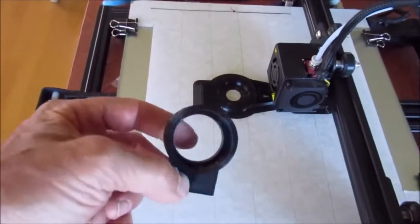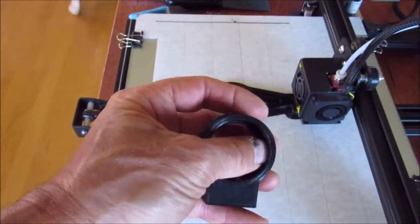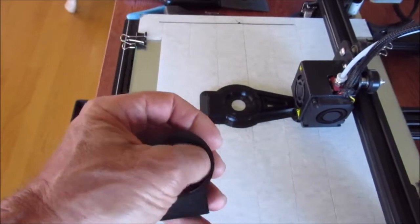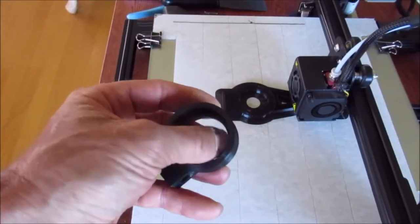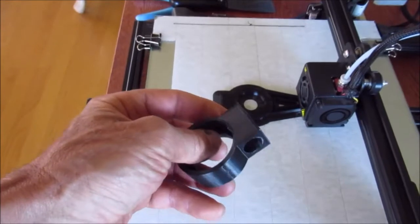It takes 9 hours to print, and I'm hoping that 8/1000ths of an inch is enough for clearance. I don't want to sand everything down. I've been trying to get my measurements and clearances just right so that I don't have to handle the part more than once, because it already takes 9 hours to print. Why would I spend another hour to make sure they fit?